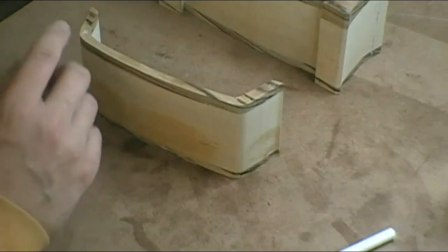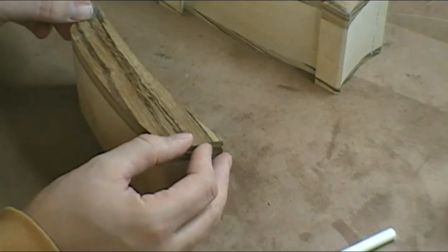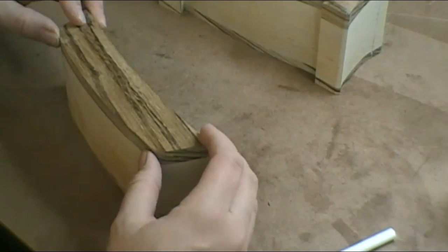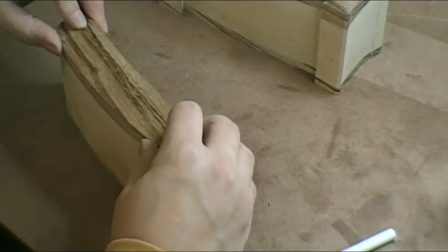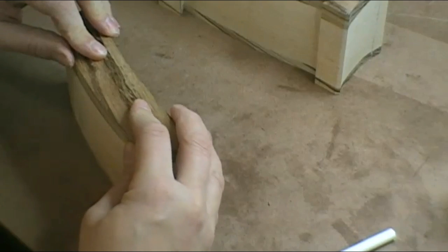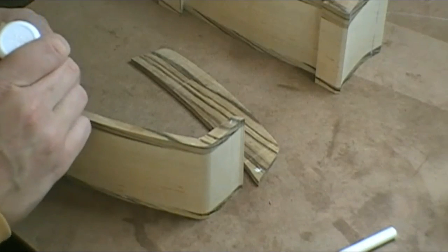So here I've got the letter F. Here's a letter F for front. So I know that the two letters kind of face each other. One is for the inside. The other is facing out, so I can see it. That goes there. Okay, so everything looks pretty good. I'm feeling that it's going to line up pretty decently. Kind of like a dry fit before we go through with the actual glue up. And then I want to feel where I need to be. Maybe about there, there, and there. That's perfect. Good. Now time for the glue. Same as on the back. Just on a little line.